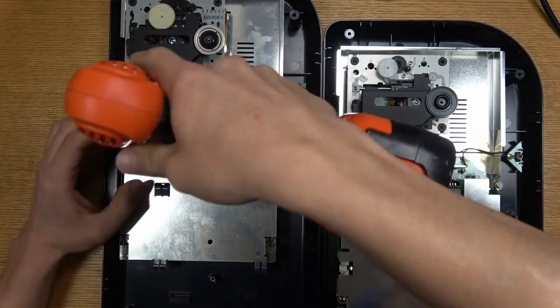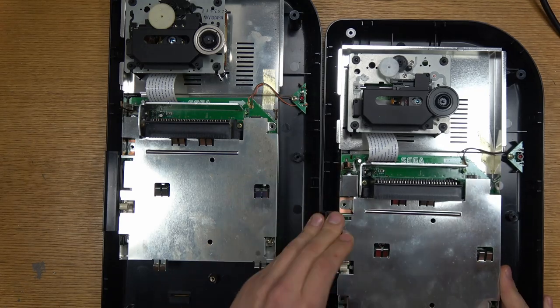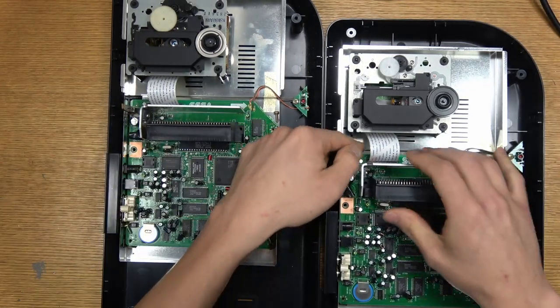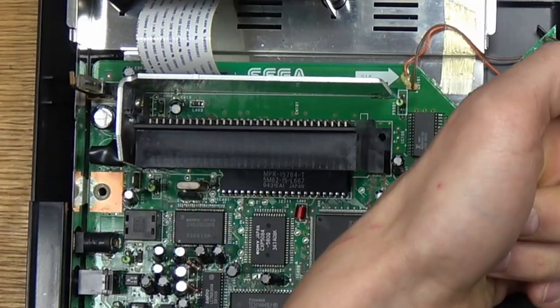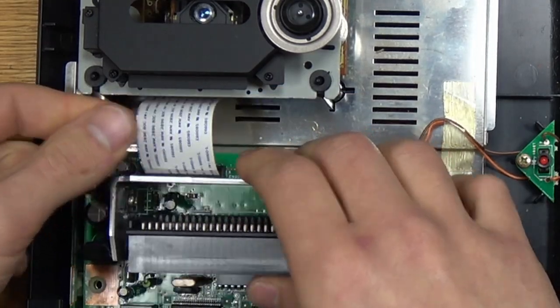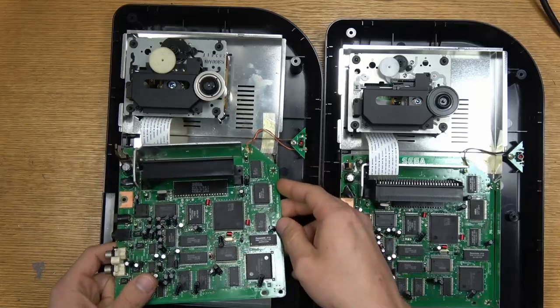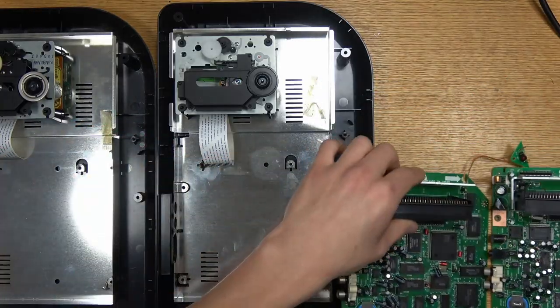Where it's just remove any screw you see — take it out. You've got screws on the connector slot and screws that hold the heat plate down, and then you have these ribbon cables which you need to remove. If you have the other motherboard revision it'll just be some clips — they're pretty similar, but the fuse is in a different location, so that's what I'll be showing you.